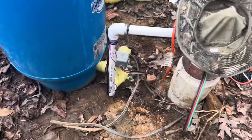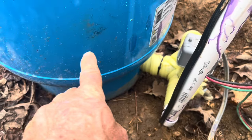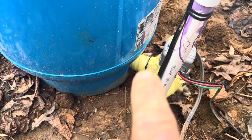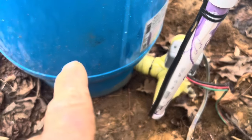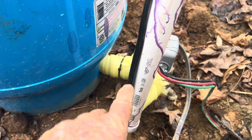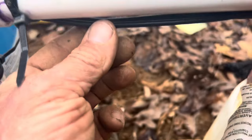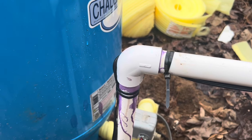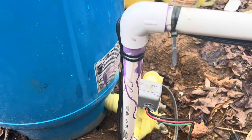I've got the tape in here. It's easier to put these heat tapes — this piece of pipe that goes into the pressure tank comes all the way back to the middle, so we put a loose-fitting zip tie on it and tried to push the heat tape in as far as we could and wrapped it. Basically, the heat tape should just have one layer on the pipe, preferably on the bottom, because heat rises. We had to wrap it around a few times because this heat tape was a little longer than what we needed.